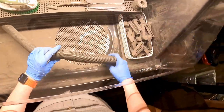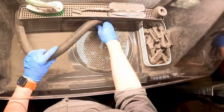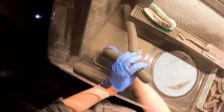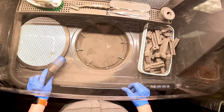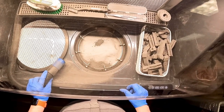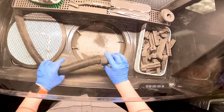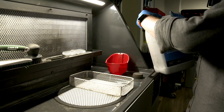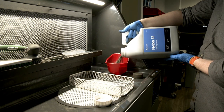The integrated vacuum and air filtration system ensures that loose powder is contained in the work area, keeping the post-processing experience both clean and tidy. Once we've excavated our parts, the excess nylon powder drains through the sift filter to catch any environmental contaminants that may have been introduced during the unpacking process. The sifted powder then enters a storage hopper alongside a separate hopper of fresh nylon 12 powder.